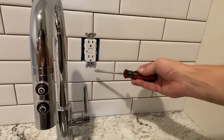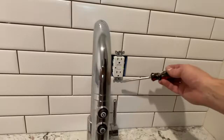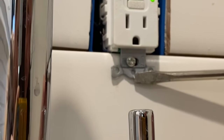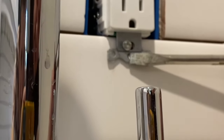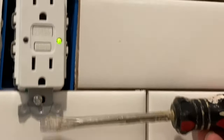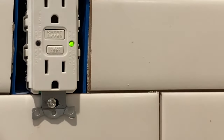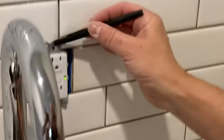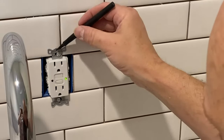Right here actually — you can see I cut the notch for this screw, but not this screw. Now if you go ahead and do the whole job and you forget this, what you can do is put a little mark there with a pen, then pull this out and take a tile drill bit and just drill it out. That's what we'll have to do with that to rectify this. But up here, you can see I caught my mistake, and I have that hole open.